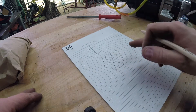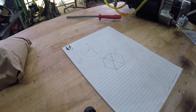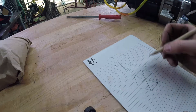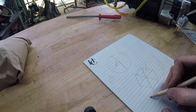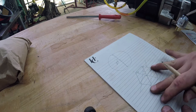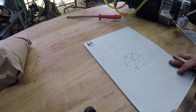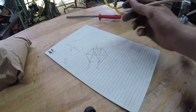I should be able to cut all these out and weld them up on my welding table, making sure everything is flat, and then weld it to my lid. I'm also going to add some bars across as handles — just spot welds on a couple of corners. That'll reduce heat transfer from the lid into the handles and also provide more rigidity. So that's the plan — let's go cut some metal.